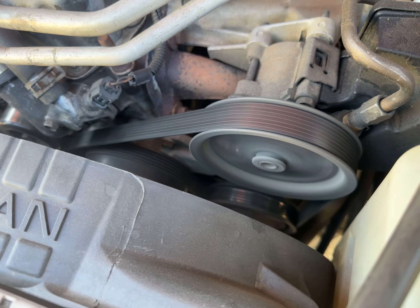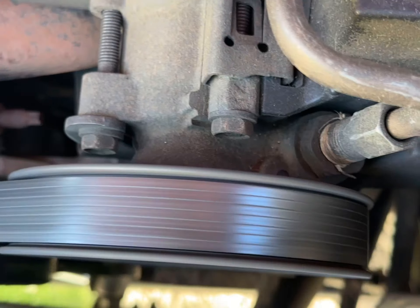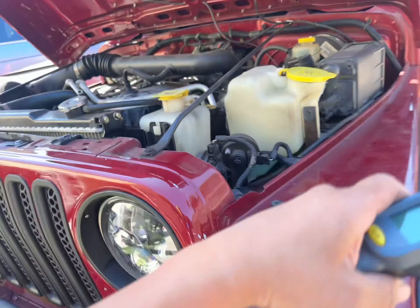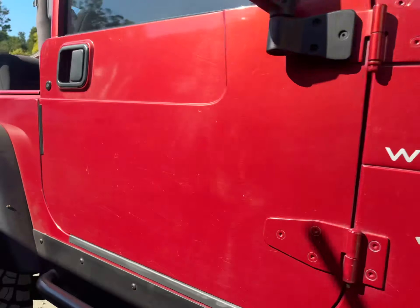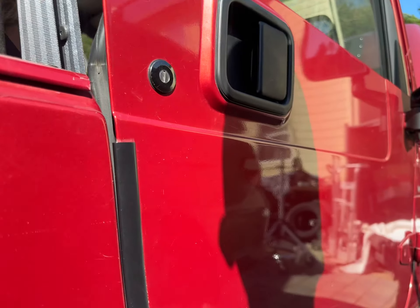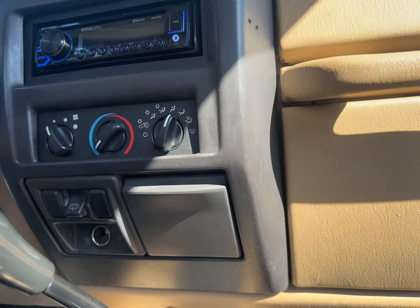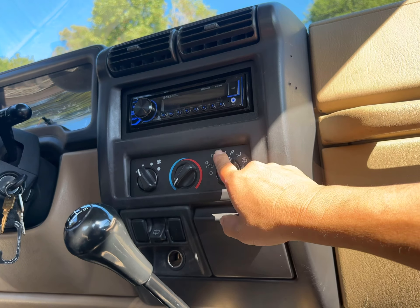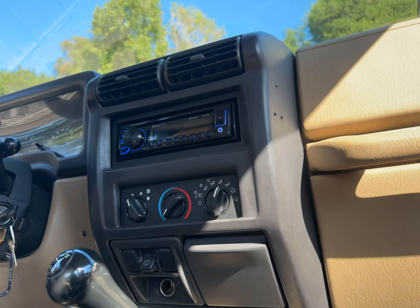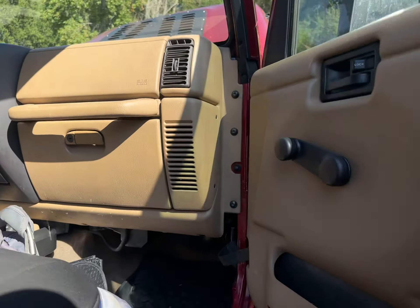It must be so low on refrigerant that the compressor turned off. So that's good — turn it off and on again. All right, compressor is running. That's a good sign. So the compressor does run, but it's probably so low that it eventually shuts off. There are no LEDs, but once you turn it on I do hear it click. All right, now you can shut everything down. Okay, that's our baseline.